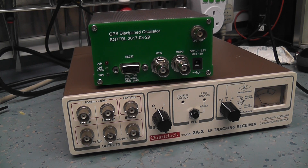There was a French station that closed down in the late 2000s and no longer transmits. This unit will probably be redundant in 10 years' time, but I was intrigued to see how it works. It tunes to 198 kHz, strips out all the modulation and is heavily filtered — all it's interested in is the 198 kHz carrier. It's extremely refined and very accurate because it's running off a cesium standard, so in theory it may be more accurate than the GPS-disciplined oscillator.